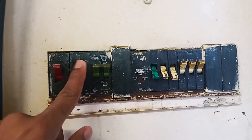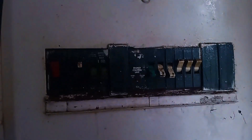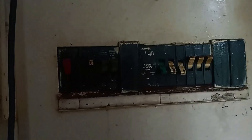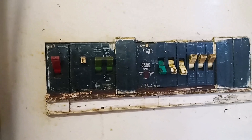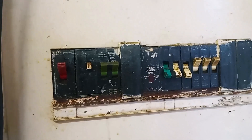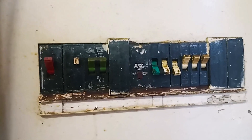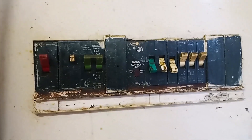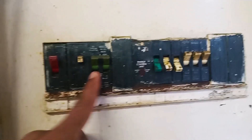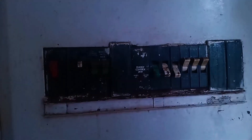Right now it's not working. The only way to trip this circuit is by dropping the breaker itself, but that is not safe. So in case of an earth leakage in this house, leaking on equipment, the persons in this house will be exposed to a risk of electric shock, which is a problem. So this unit must be replaced so that safety standards can be restored.